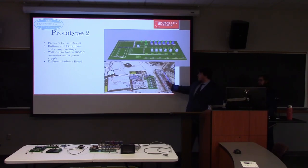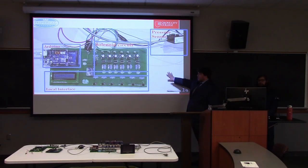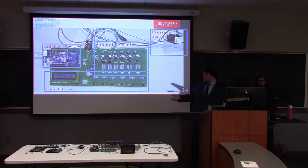On this first board we were using two input voltages, and we changed it to one with an onboard DC-to-DC converter. This is the second prototype fully soldered out. We actually took this prototype to Imperial and tested it in their dust collector, and it worked just as we expected. You can also see an Ethernet shield on top of the Arduino, which allows us to communicate over Modbus to either a PLC or a computer.